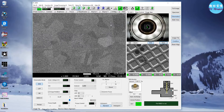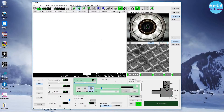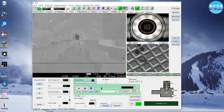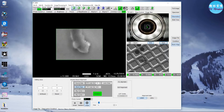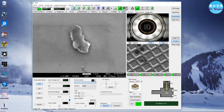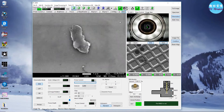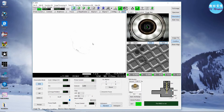Now move the crosshair to the center and change the beam current — probe current — to large. I normally use 16; our current is 15, it doesn't matter, we can change it later. Whenever you change the beam current, probe current, or kV, you need to refocus and re-align, but it's quite quick. Change to 16. The brightness is much higher, which means you are getting more electrons.